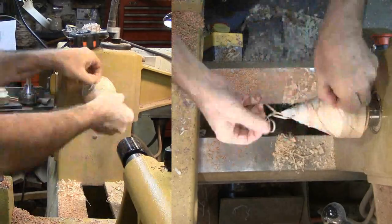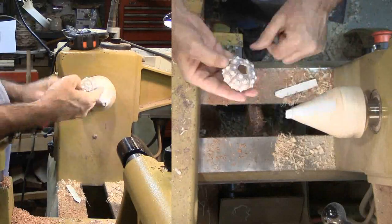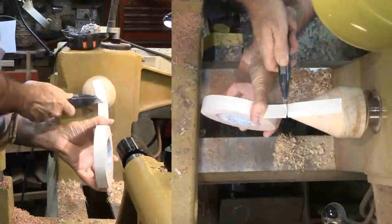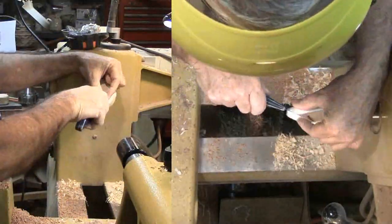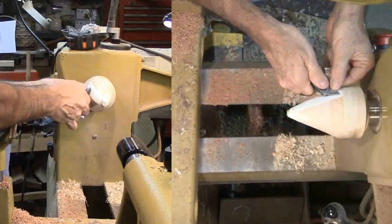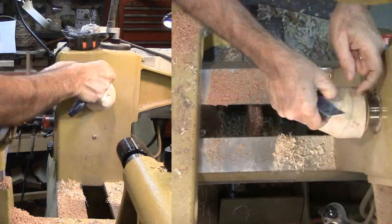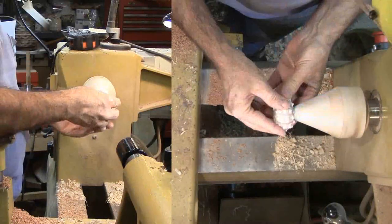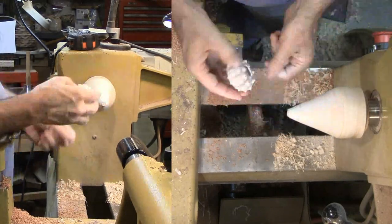Before I started, my wife coated the inside of the sea urchin shell with white glue. This makes it just a little less fragile. Now I need to ensure the top and bottom holes are uniform circles. Previously, I had turned a short cone on a wood faceplate and put strips of pressure-sensitive adhesive sandpaper on the cone. But that did not work, so I adopted Rex Burningham's technique of applying double-sided tape under the sandpaper. Finally, I could sand the insides of the top and bottom holes to get them even.